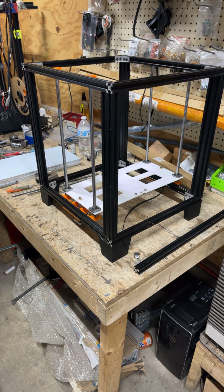And this is aluminum. It's just got an anti-scratch coating on it. And you're going to leave that on when you do it, because you're going to get shavings. Again, some of them might go underneath a little bit when you drill, and that could scratch the bottom side. I'm going to do a separate video on buffing this thing so it's shining like silver pretty much. It's not a required thing, it just makes it pop a little bit, makes it look real nice, the area that you can see.